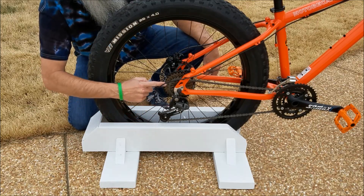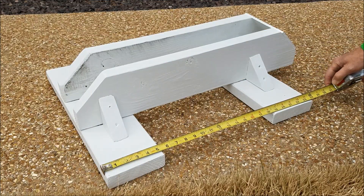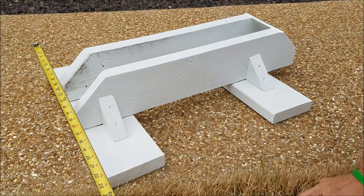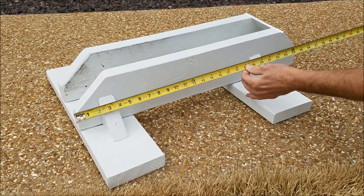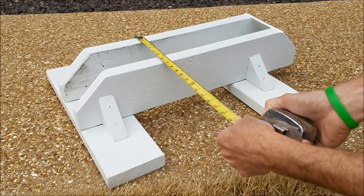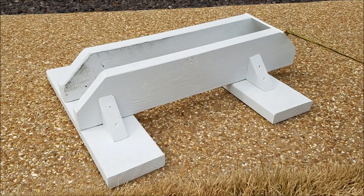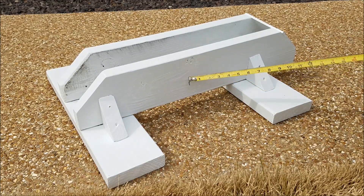I found the higher gears work perfectly fine. The distance from front to rear on the base is 24 inches. The distance of the base is 21 inches side to side. The uprights are 28 inches. The distance from side to side is 7 inches. This angle I cut at 40 degrees front and rear, and these pieces help stabilize the uprights.